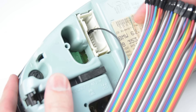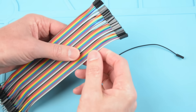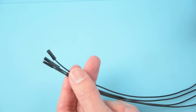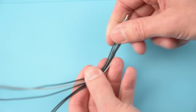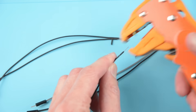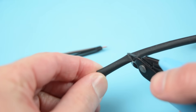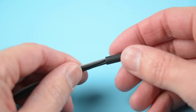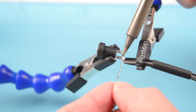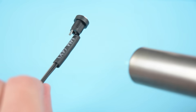For the wiring we'll use Arduino jumper cables which can plug directly to the pins on the back of the cluster. To begin with, prepare five wires for the ground connections — four wires with female ends and one wire with a male end. At the other end of the wires, cut off the connections with wire cutters and strip the ends. Next, join the five wires by twisting the ends together. Cut a small piece of heat shrink tube and place it over the ends of the wires. Connect the wires and solder the ends to the negative terminal on the DC jack. Then slide the heat shrink over the solder joint and apply heat to shrink the tube.